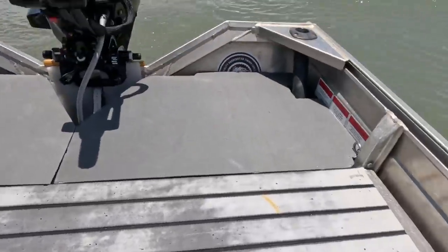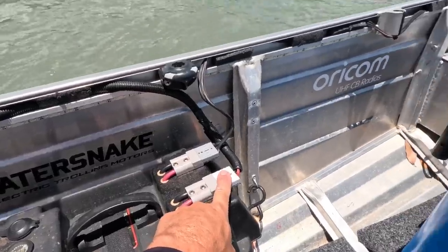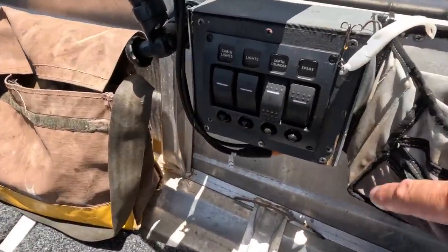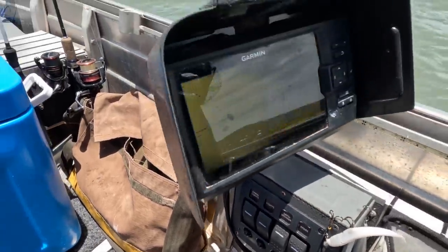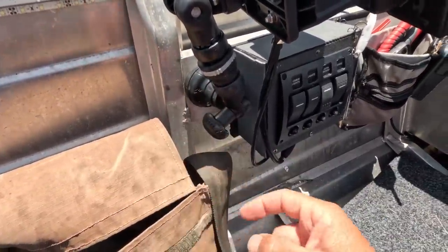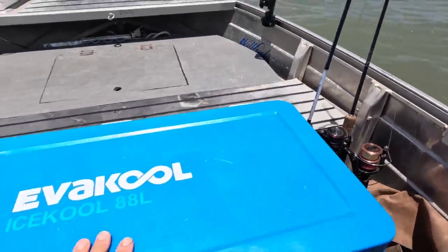The battery box goes in here - I've put a couple of stainless links and a ratchet strap so it bolts in there and I can pull it in and out no dramas. One Anderson plug runs up to the Eleki, and another Anderson feeds across under the seat in conduit and comes out at my little switch panel. I've got a depth sounder, lights, cabin lights - all individually wired with circuit breakers. The depth sounder is the same Garmin one I always had, but I bought this Railblazer mount. You can put them anywhere in the boat, run different fittings, and this one holds the sounder so you can pivot and swivel it. It's also got a little shade screen so you can see it during the day.